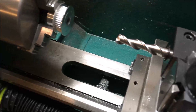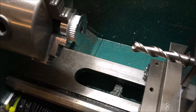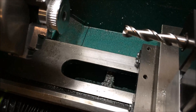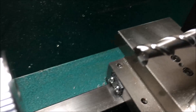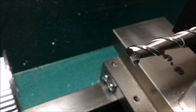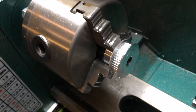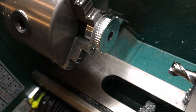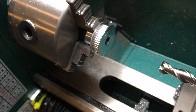Here is a quick little demonstration of using an end mill as both a drill and a boring bar. Sometimes a two-flute end mill works really well for drilling and boring in aluminum. I haven't run this program yet, I've only dry run it, but hopefully it will work without crashing. Normally I would hold something like this differently, but the hole I'm creating is just for clearance, so I'm just going to hold it in my chuck. I don't care if it runs out a little bit.